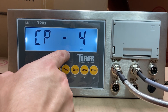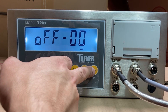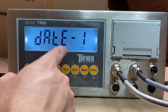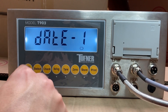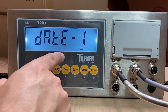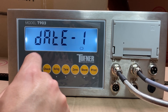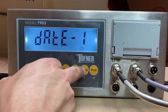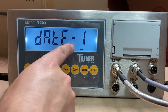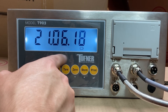You'll see CP4 — not important. Then a time setting showing Off, and a backlight setting also showing Off. Next is the date setting. Date 1 means it's in month/day/year format. If you're somewhere else and want day/month/year, change date to 2. For most U.S. customers, we keep it in month/day/year for printing.